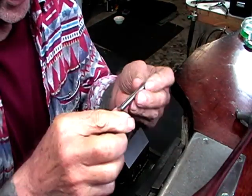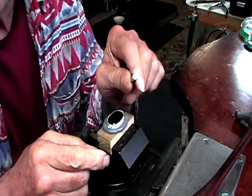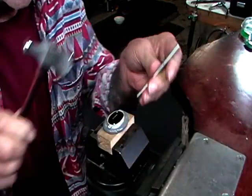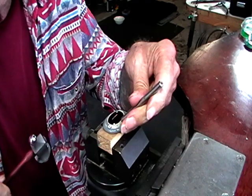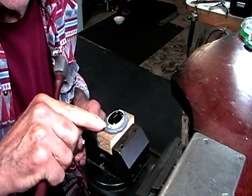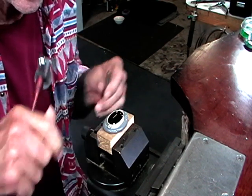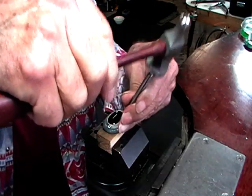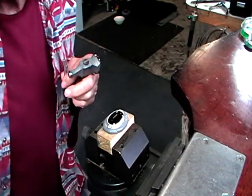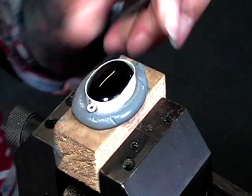Okay, we're ready to rock and roll. The punch is nothing magic — it's just polished flat steel. And I always work towards myself so that I can actually see the edge of the metal coming over. The trick is if you can't stick your fingernail in the plastic, it's hard enough to work. So I'm just going to tap that over on one side. I'll zoom in so you can see it's moved over against the stone.